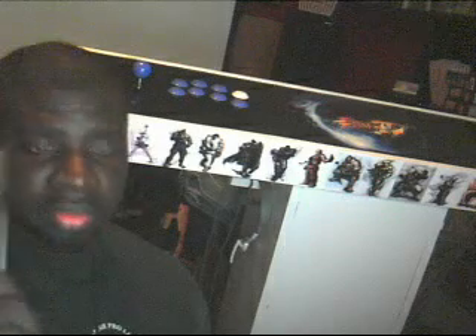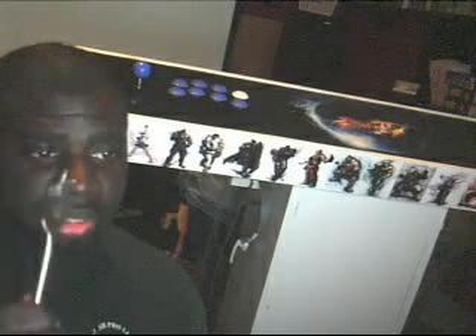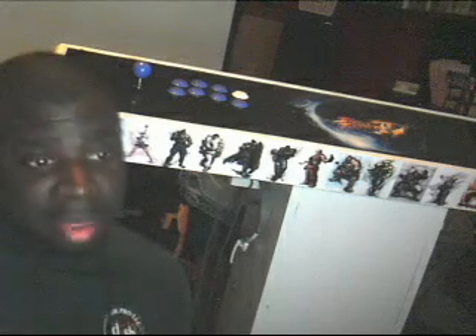The OBSF-30 button — I use the 1 and 1/8 inch drill bit. Now this is actually a little bit too small for the button, but if you get one size bigger it's gonna be too big. So I use this one, drilled a hole, then got my file — it's just a little bit too big — put it inside the hole and filed around the inside, tested the button to see if it fit, filed around a little bit more, and got the button to fit in perfect. I did all the buttons like that and it came out perfect. I don't have a problem with the buttons whatsoever.